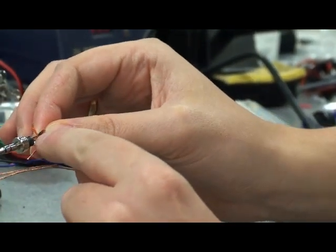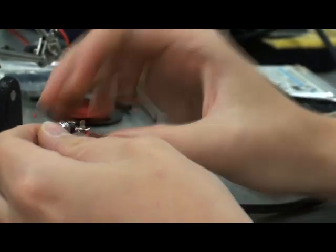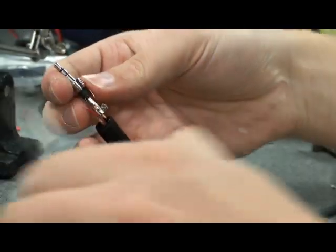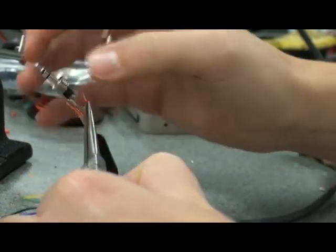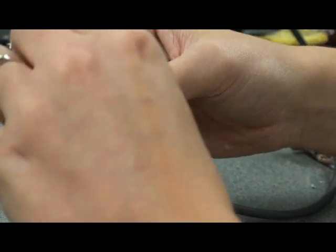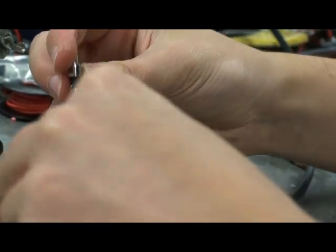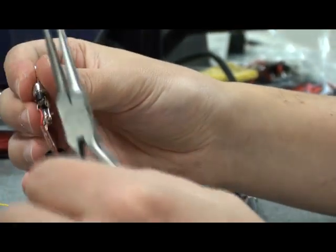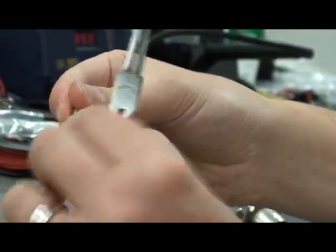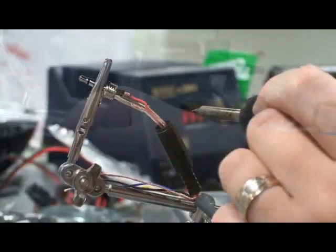And I will apply some solder on this end here, and then obviously solder the other 2 guys from the inside. Now when you're connecting these two, my preferred way of doing that is simply to approach them from the inside going out, because it's going to be easier to solder, but also it allows you to use the opportunity that hole gives you in terms of structural integrity. Bend it here, and because it's about 3 or 4 millimeters, it doesn't go too far forward. And we need to do the same thing with the other wire. Make sure that you untangle them so they're going to be sitting on top, like so.